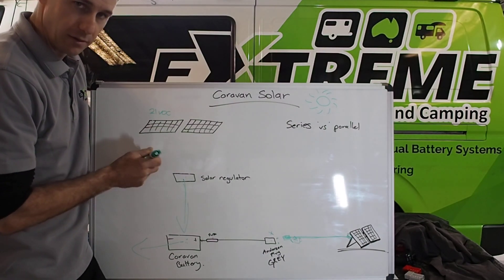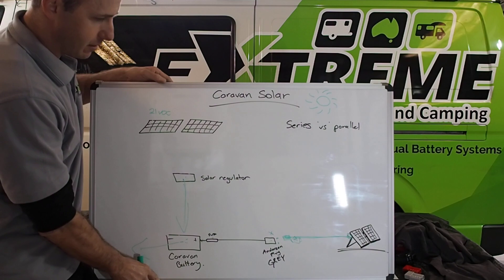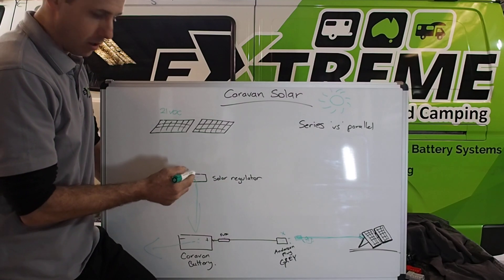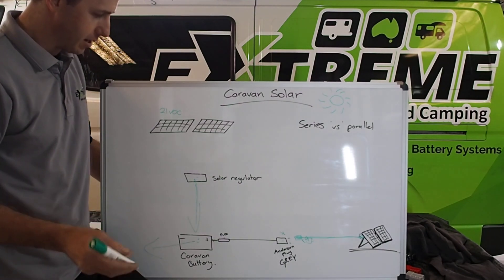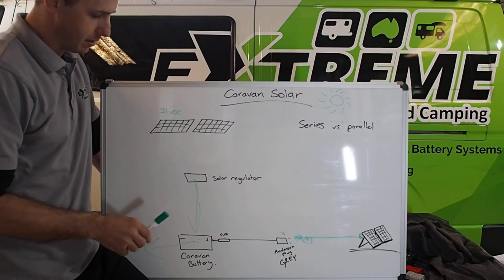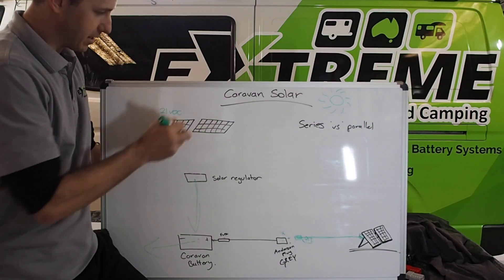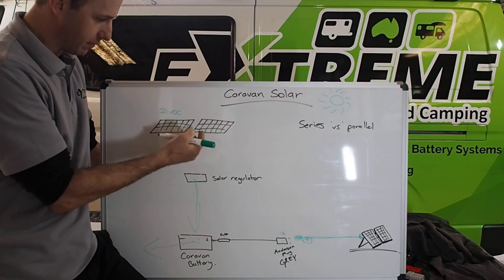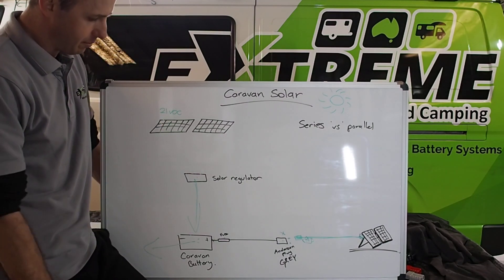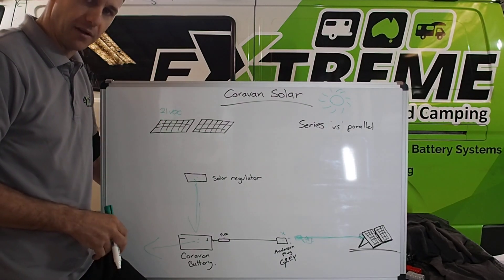Now the wiring on the roof of your van is done either parallel or series. I've done both and I still do both. It all comes down to your charge controller — the ones I generally use have a 100V PV range, even a 150V maximum voltage range on the input side, and they're all MPPT charge controllers for maximum power. What MPPT does is basically hold the panels at a set voltage so it can monitor the amperage coming out and find the point where it's producing the most amps. That's pretty much how an MPPT charge controller works.